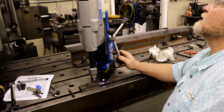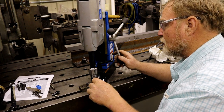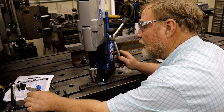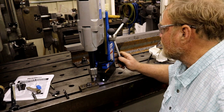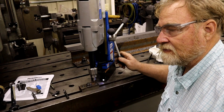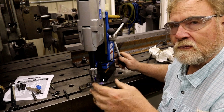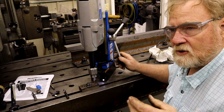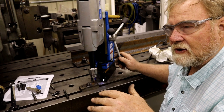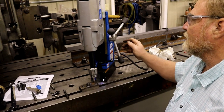Okay. Let's start there. Then we'll take the 2964 drill and drill into it, and then come back with the carbide and make the bottom flat. The whole reason I want to make the bottom flat is I don't want an air void in there. I don't want a void of a lot of red Loctite either. I want the metals to all be as uniform as possible through there, so that when it's cooling down and heating and expanding and contracting, you won't have an air pocket or a pocket of a material that expands at a different rate. So that's my thinking.